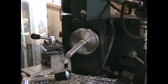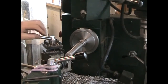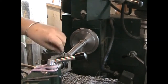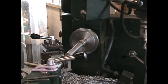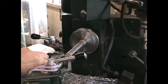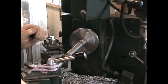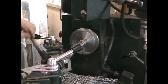Now we'll drill a little hole in the end and put a 3/8 tapped hole in the end of this shaft for our mop to screw on. We started with the center drill and now we've got a pilot drill — putting in lots of coolant to keep it cool. We're checking with the tap to make sure the hole is deep enough. It's good to have some clearance at the bottom of the hole for the chips from tapping.